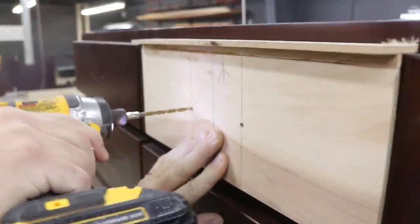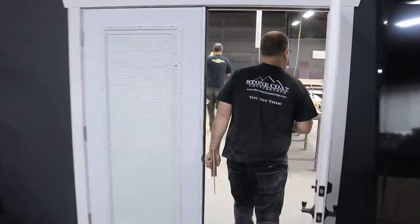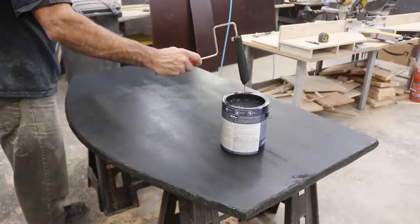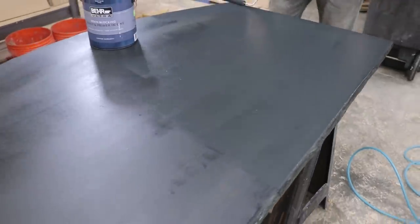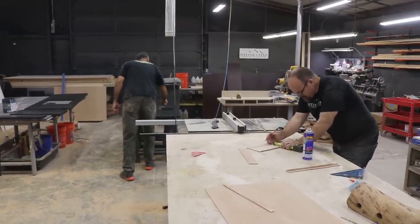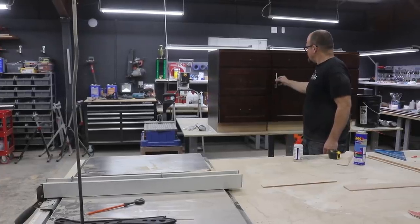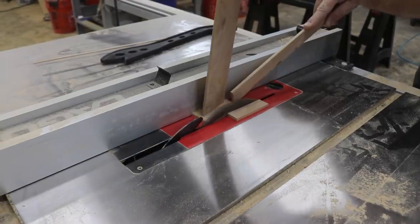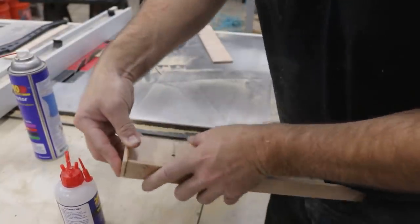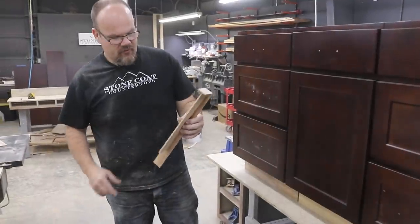There we go — now it's time to do your doors. We'll make a new template. Why two coats, Mike? Especially on raw edges on MDF — it soaks it in like crazy. You really only need it on the edges, but it doesn't hurt doing the whole thing. If you seal that wood really well — same reason you prime a canvas — just to get it sealed up. On your handles, I would probably recommend starting them about right there.